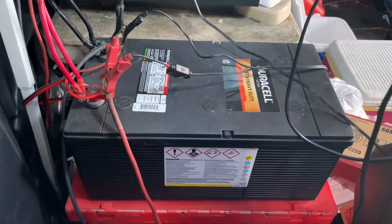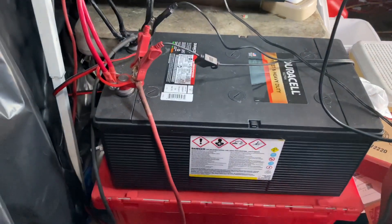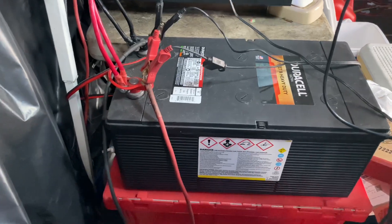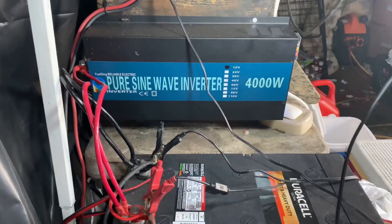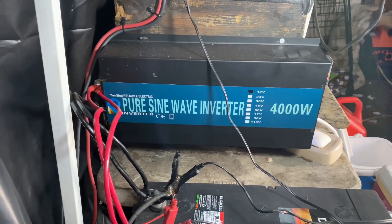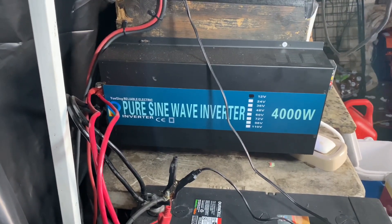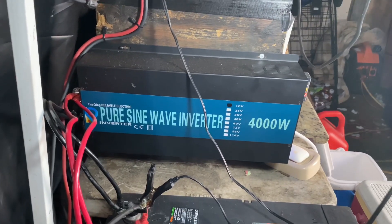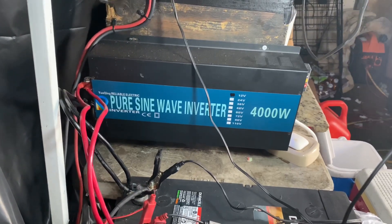By adding three more batteries, making it four total, we reach 100 amps of sustained draw. With eight batteries, we're at the criteria the power inverter needs for sustained use near 4,000 watts. We don't want to push 4,000 watts — we want to stay at least 10%, and ideally 20%, below. So what's recommended is not to exceed 3,700 watts, giving us a 300-watt cushion in case something is added to the system.